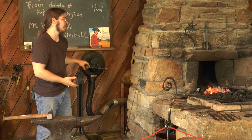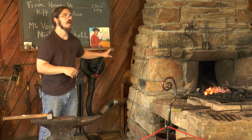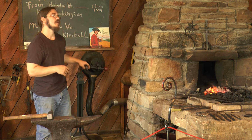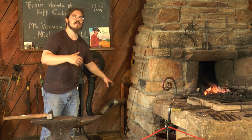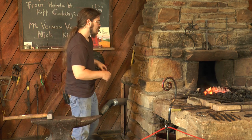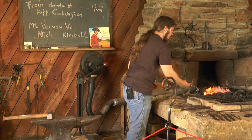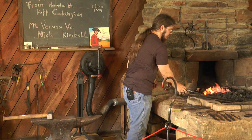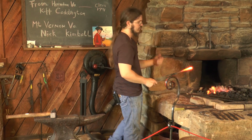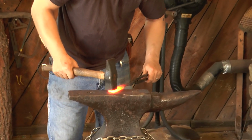As you've been hammering on it, you've been moving them around, smushing them together. They're not in a natural state. And so by annealing, you're giving that material enough time to shift itself back to a more stable position. And you can do that a few times, anneal it a few times to make sure it's really where it wants to be. All right, so.